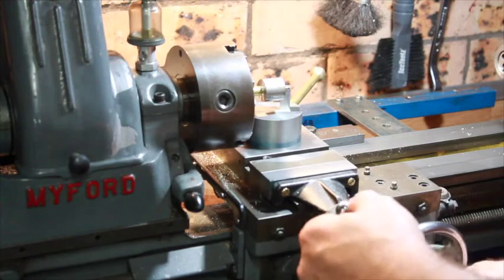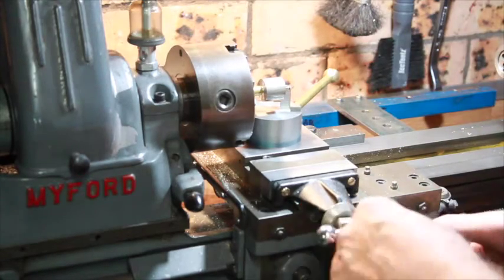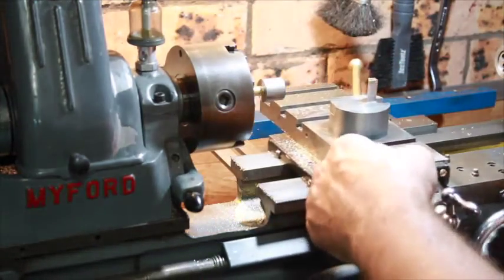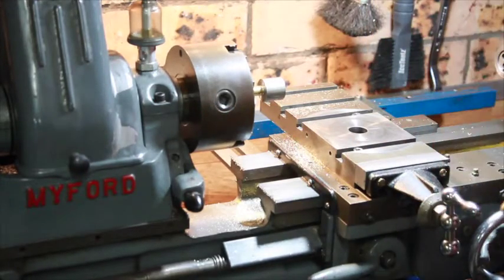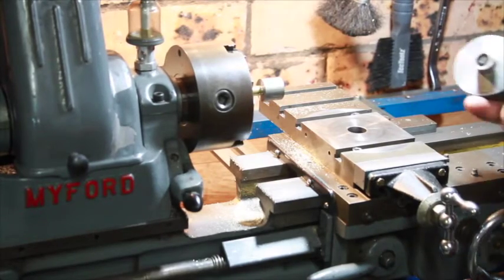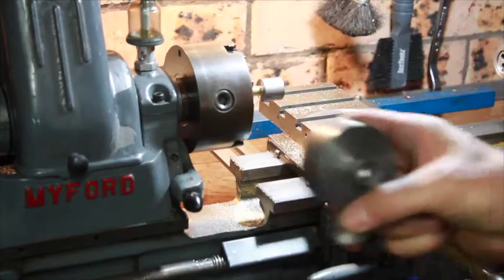With the spacer, you can line it all up and off you go — you can cut. Usually you start out here and move in. What I also found was that this bounced around quite a lot, so I had to make a retaining plate for that as well.